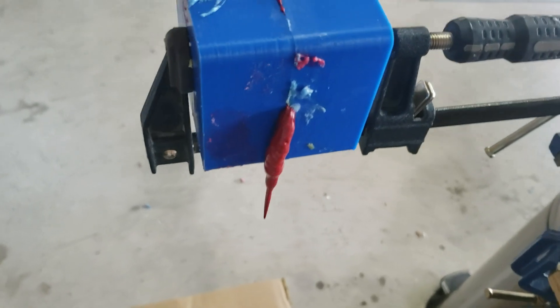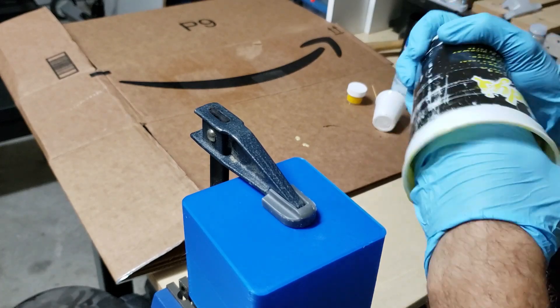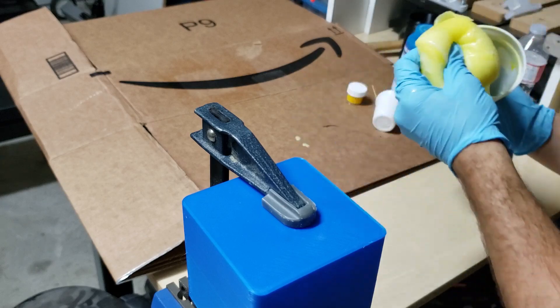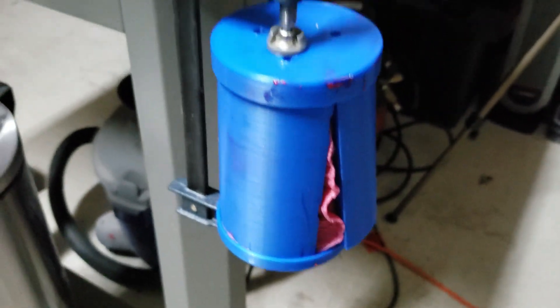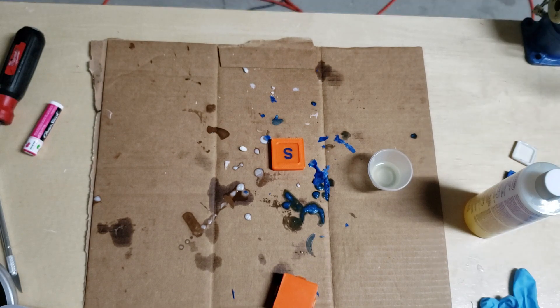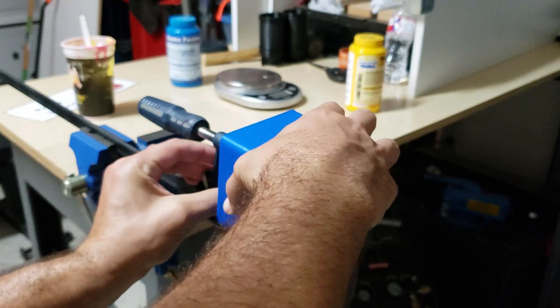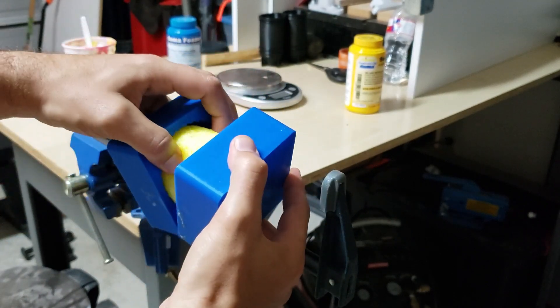For the cure, I do this two different ways depending on whether I'm working with foam or rigid materials. For foam, I let it completely expand and cure — the way I check is I look at the cup I mixed it in, remove the material, and that tells me if it's fully cured. The foam isn't always super strong if it's not fully cured. Here's an example of me overfilling a mold where it expanded too much during cure. With rigid urethane, the material starts out clear and I know it's cured when it turns white — once we're happy with the cure, we move to demolding.